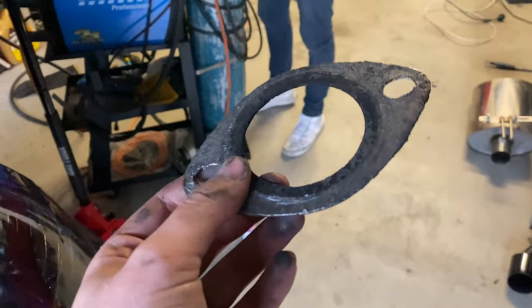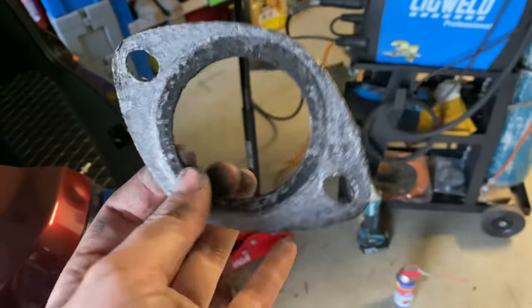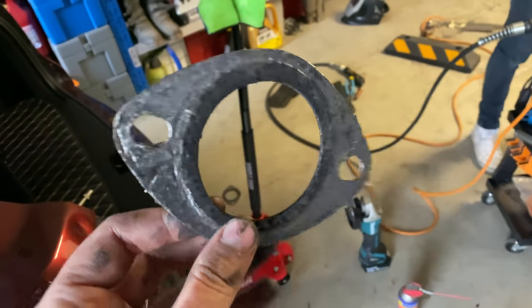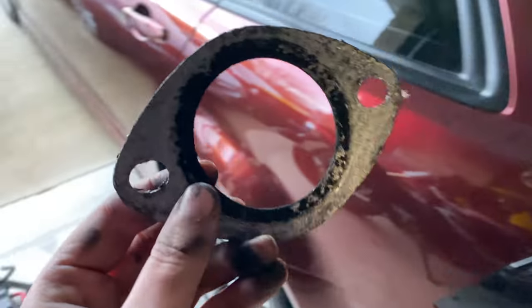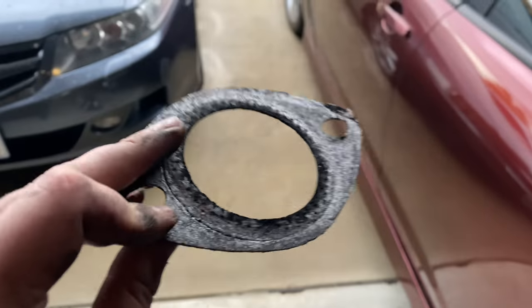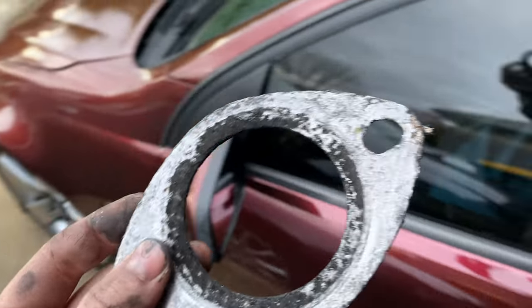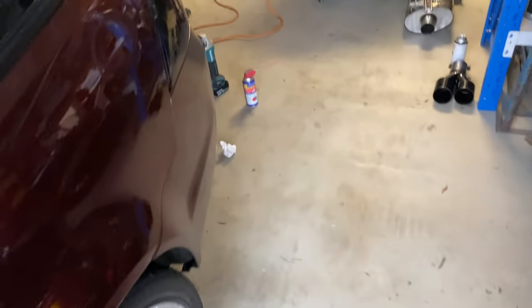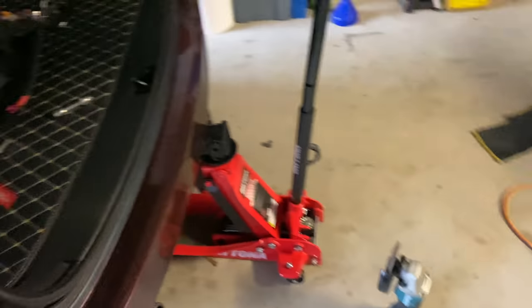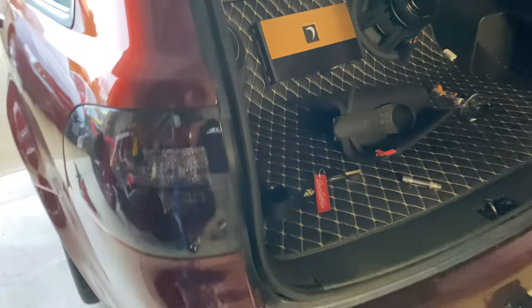Keen to hear this. We actually noticed these flanges are for a 2.5-inch exhaust, not a 3-inch exhaust, and you can actually see the carbon build up. As Will said, they would have been blocking the flow a bit and also probably changing the sound a little bit too. We've just used gasket goop this time instead of a physical gasket, which would be perfect, but we're just cleaning up now because we finished it off, so we should be able to drop it on the ground and listen to how it sounds.